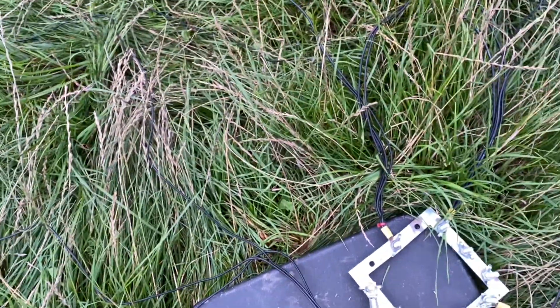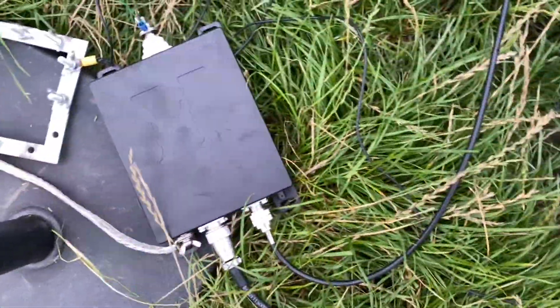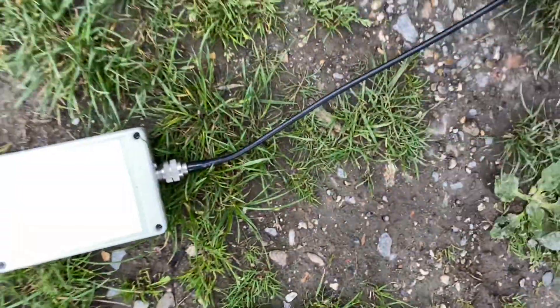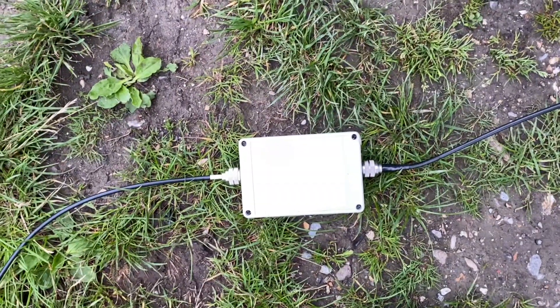You can just see them in black. This is the coax and this is the control cable going into the Sentry 300. The coax is running around — approximately 40 meters of coax in total. It goes into the line isolator acting as a choke and then the rest of it goes to the car. So that's the setup.